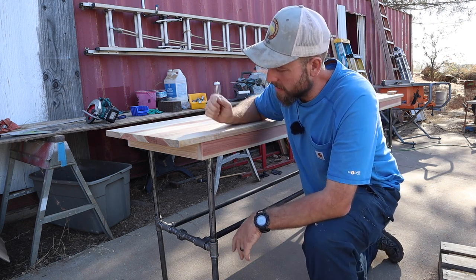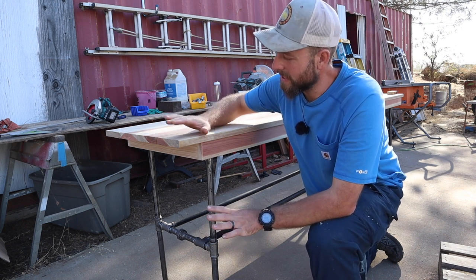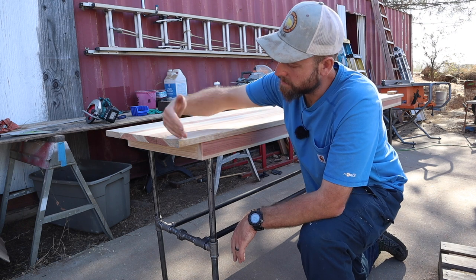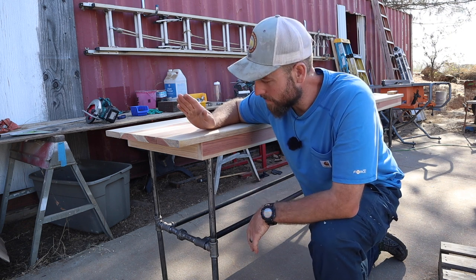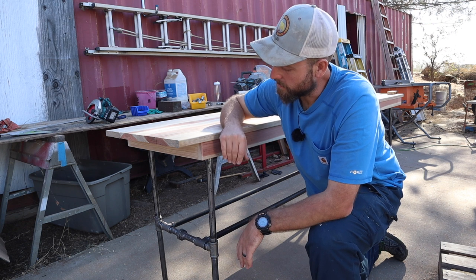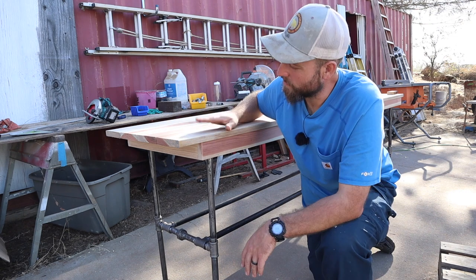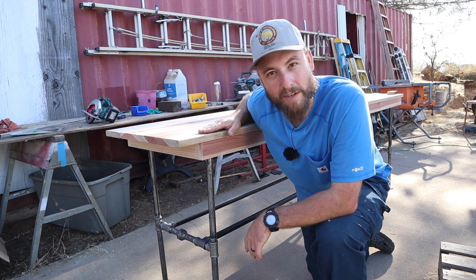One of the things I mentioned at the beginning was to cut your boards long. The reason I did that is because it allows me to have variances on these boards — it's hard to cut a board the same length every time without special chop saw equipment. So I just cut them long and then I'll cut along here and that should be a nice straight cut. I use a very good blade for situations like this, keep it stashed. Then I'm going to round the edges and sand them so it has about an eighth-inch round before we put a coat of whitewash on it.